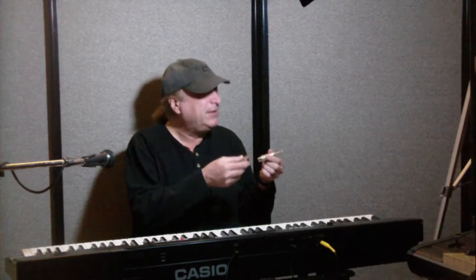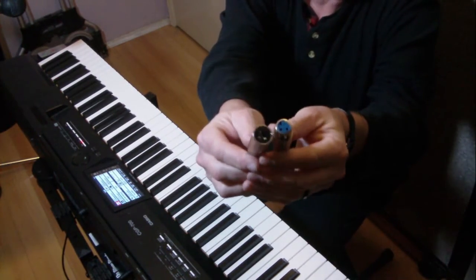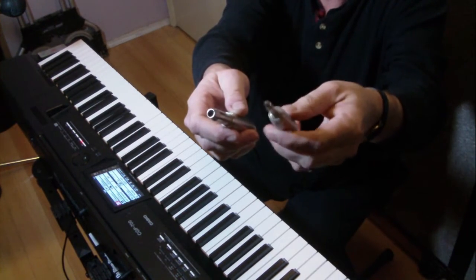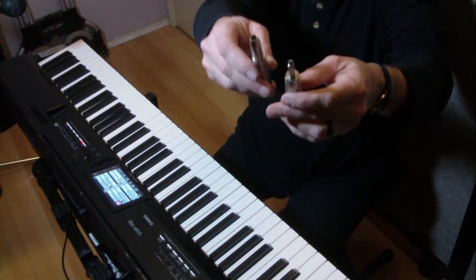The other end of the mic attenuator is also XLR, and you take that and match it up to your amp. But keyboards are line level and use quarter-inch cables. So in addition to this mic attenuator — which costs between twenty and forty dollars instead of the several-hundred-dollar reamplifier — you need some kind of adapter to convert your quarter-inch cable to XLR. Here are a couple of different types: one is male XLR, the other is female XLR, and the other end of each is quarter-inch.